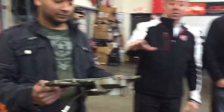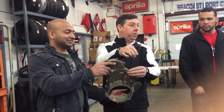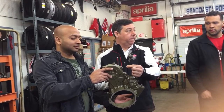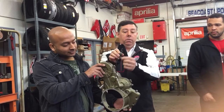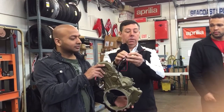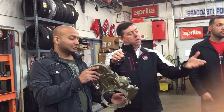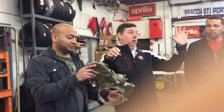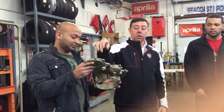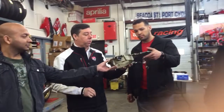We're a small company; we can't afford to have things with issues over a long period of time. Notice that this is the oil pressure sending unit. Why do you think this flexible line is here? Vibrations — that's right. It's a very, very sensitive sensor, and over the past few years these sensors had a tendency to fail. So we isolated it — put it on an isolation cable. Now the sensor's bulletproof, no issues, continues to read and do everything it's supposed to do.